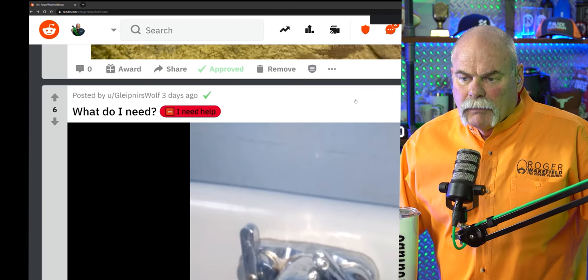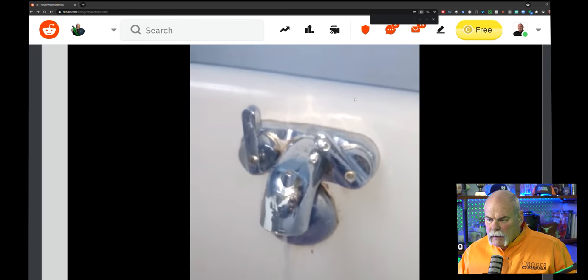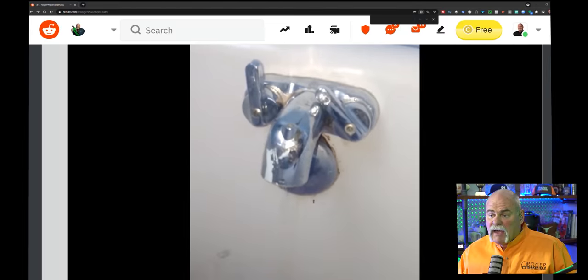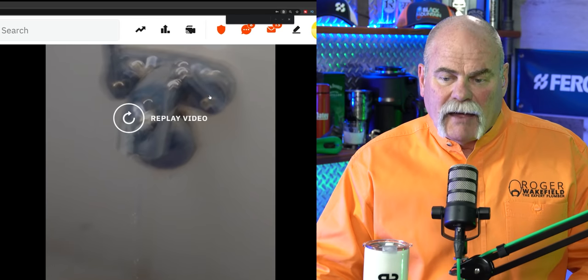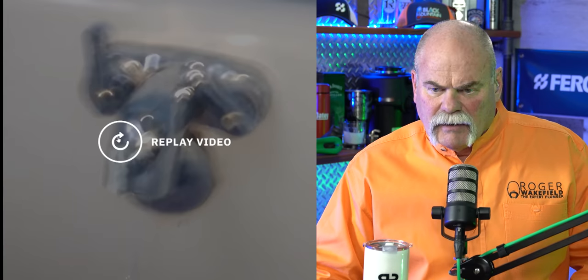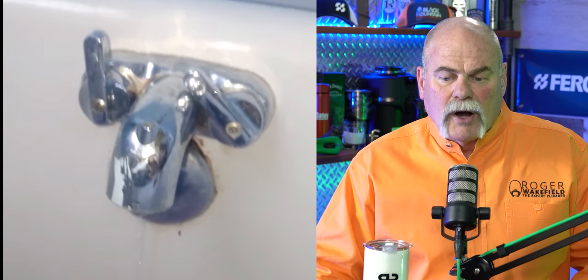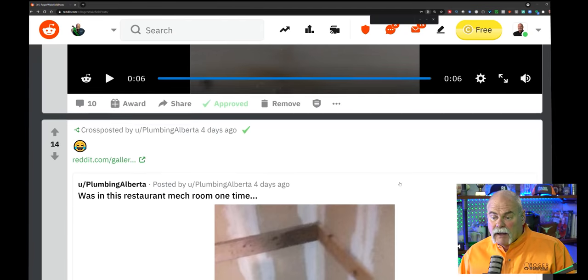What do I need? Just a glass — you've got the water running, just catch it, or wait 45 minutes to take a bath because it'll take about that long to fill up. It looks like you take these screw handles off, take it apart — you'll have a washer in there, probably need to replace the seat. All kinds of different things, but it can all be done.